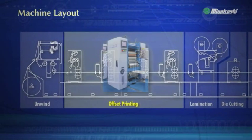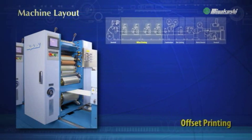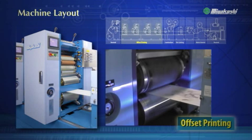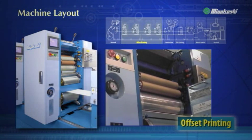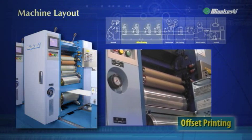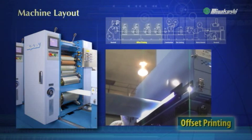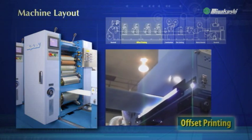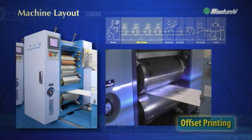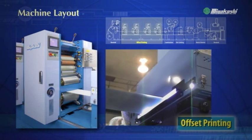The offset printing unit runs intermittently with a sectional motor. So there is no need to change cassettes to alter printing size anymore. And there are few printing gaps too. Compared with existing machines, there are more oscillating rollers and ink form rollers mounted, achieving high and stable label production. While wet offset is standard, waterless offset is also available as an option.